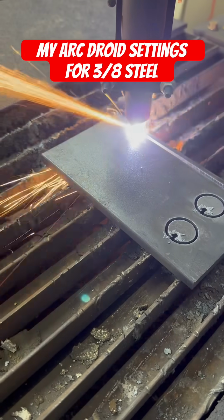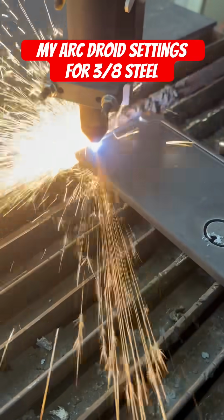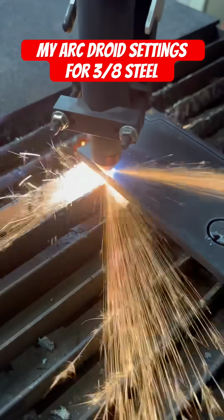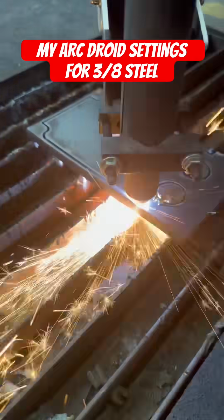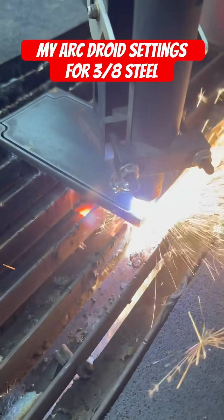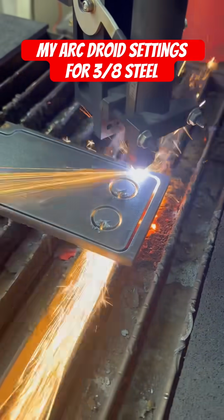The holes are plug weld holes, so they're 1-inch diameter holes. Again, this is also 3/8 plate. So that little neck down, this plate is wider than the bushing itself. And that's why I necked it down like that at the top. So it's going to look pretty nice once it's all put together.